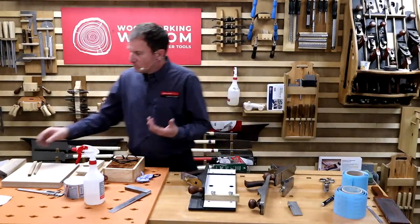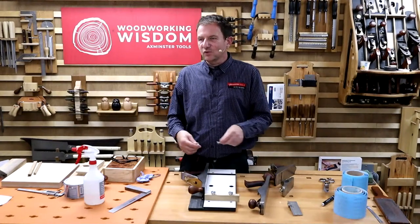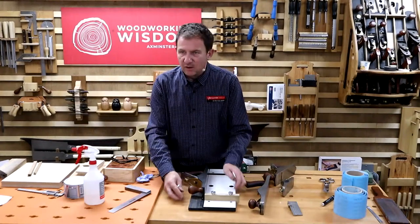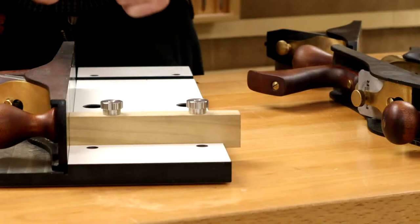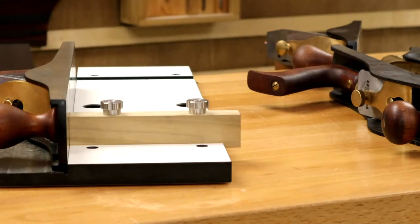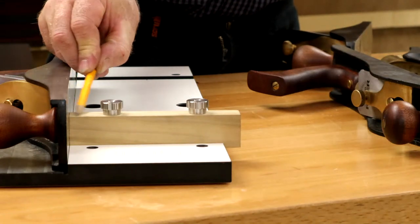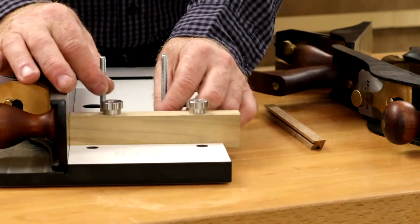Most of you have got the ability to machine up a piece of tulip wood, drill two holes, hopefully in the right place, and put a piece of timber on. So, you can easily make your own. If I bring this round just a little bit, Ben, we'll have a look on camera too. You've got your height-wise step. I'll go with a bit of oak. Right, this step, look how much it comes up from the plane. If you wanted to make a higher piece, there are longer bolts you can get.